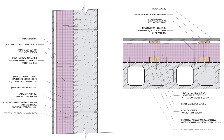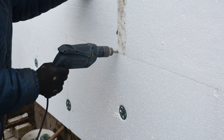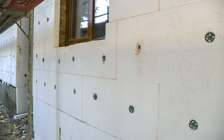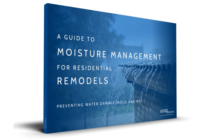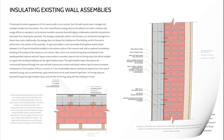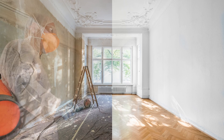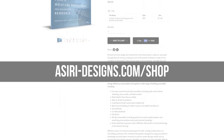The best possible way to retrofit these types of walls is to provide a water and air control layer on the outside of the block wall — usually a liquid- or spray-applied waterproofing — and then a couple layers of rigid insulation with cladding fastened to that. We basically have what we would call the perfect wall: all insulation is on the outside like a styrofoam cooler, we eliminate thermal bridging, keep the block wall dry, and keep interior temperatures cool. We discuss this strategy and more in my guide to moisture management for residential remodels, available at asiri-designs.com.